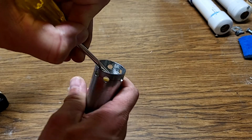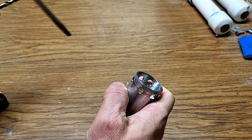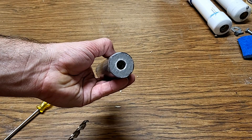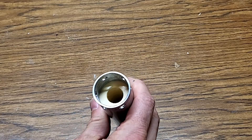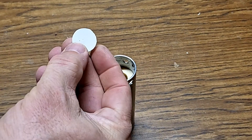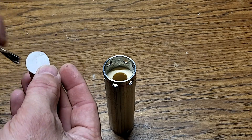I need to clean off a little bit of excess fuel that got onto the side of the pipe at the top. Once I have that cleaned off, I'm going to drill up through the nozzle with a 9/32nds drill bit just to clear out the fuel that's blocking the nozzle hole. I cleaned off any oil from the coring process at the top of the fuel and inside the pipe, and I'm going to glue a little piece of paper on top of that core hole so that when we pour the anchoring cement for the top bulkhead it doesn't pour into the core.